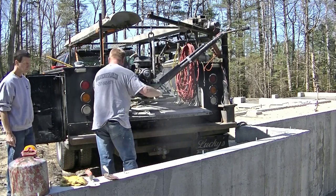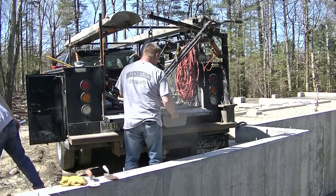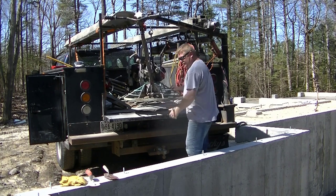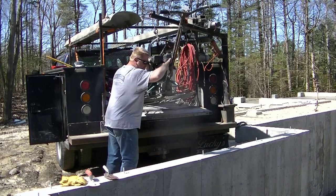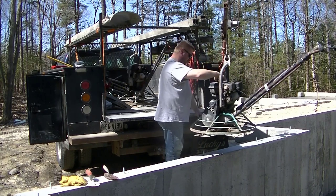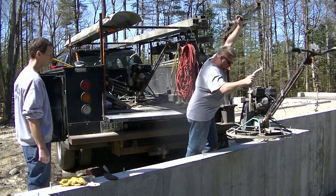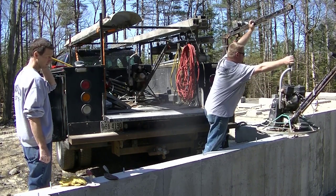My goal with this video is to help you learn about the timing of concrete — when to start finishing. That's probably one of the hardest things as a concrete finisher. You just have to keep checking it. Sometimes you can tell by looking at it; you'll see bleed water come up to the surface right after pouring and bull floating. When the bleed water starts drying up, you've got to start thinking about checking it, especially if it's in the sun. It ended up being really hot this day — mid 80s to around 90 — that's why it dried so fast.